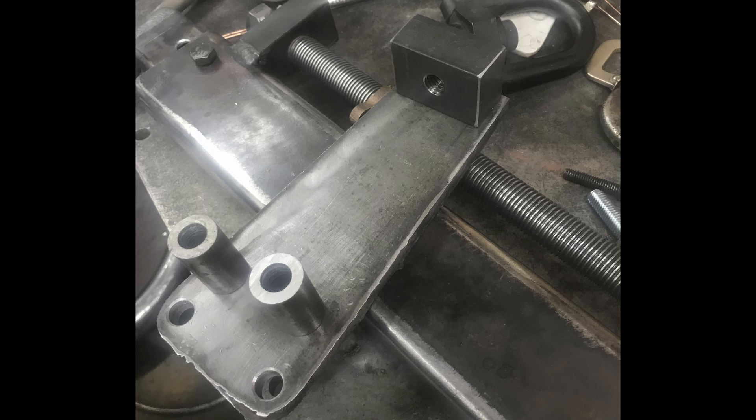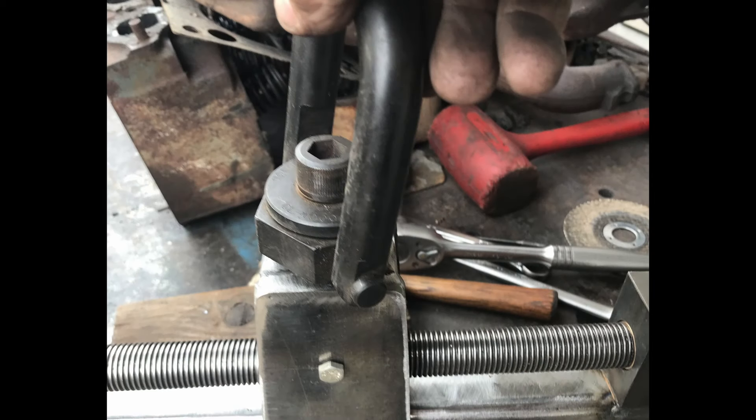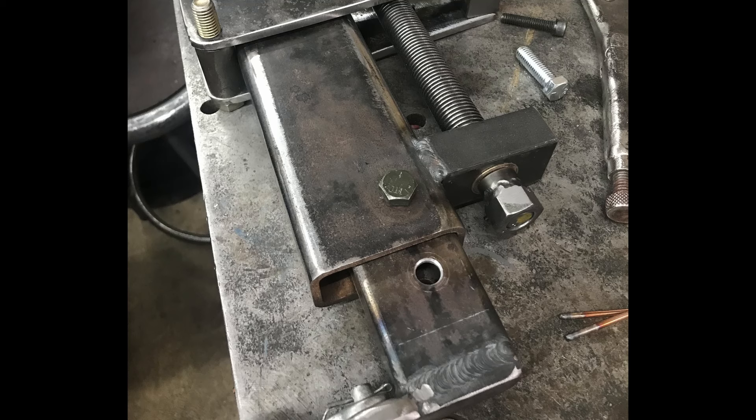We've turned our two spacers here - it was kind of a cut-and-fit process. This is another piece of that inch-thick material, drilled and tapped to accept the swivel eye. The swivel eye is just one I had kicking around - acquired for nothing or next to nothing - it was in my scrap pile for projects like this. I did rob two Grade 8 half-inch bolts out of my hold-downs on the G0755, so I'll have to replace them. I figured it was worth using Grade 8 bolts here. There's the swivel eye adapted to it, everything set up in position.